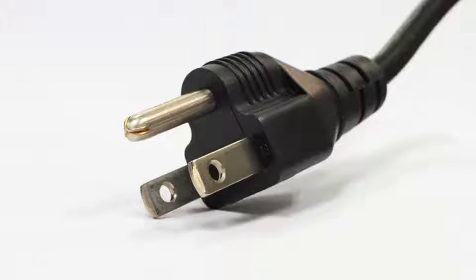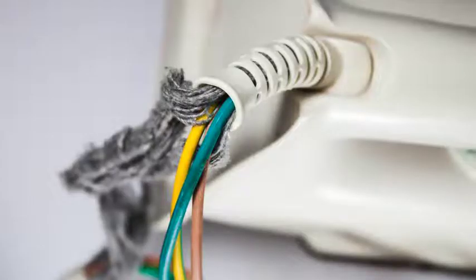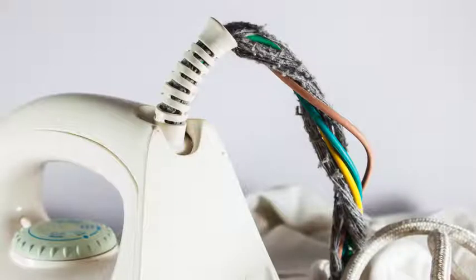Here are some tips for avoiding electrical accidents. Before plugging in a device, examine both the device and its cord for damage. Look for corroded, loose, or bent plugs. Examine the cord for cracks or frayed insulation at the plug end. Look at the tool or appliance end too.